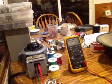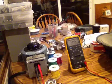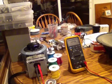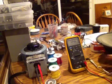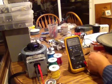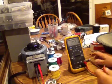This particular speaker happens to be 50 watts divided by 3, multiply it by 8 ohms — you get 133 — and you take the square root of that, you get roughly 11 and a half volts.